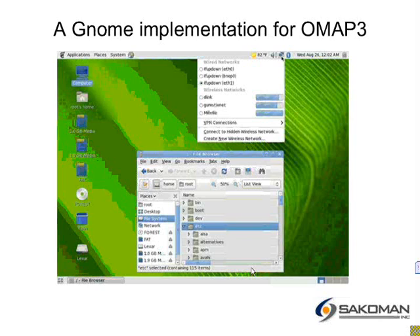If you look at some of the icons on the screen, like the one gigabyte media and the wired network drop-down, you'll also be able to tell that I have a Zippy board on my Beagle. So I have a wired network, and I have a one gigabyte SD card in the second SD slot. You'll also see the swap partition and the 1.9 gigabyte partition for ext3 — that has my root filesystem — so this will run on a 2 gigabyte SD card.